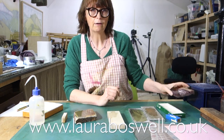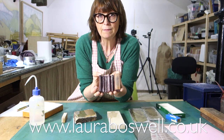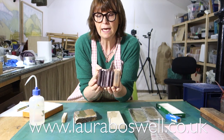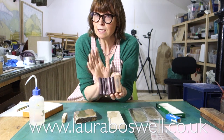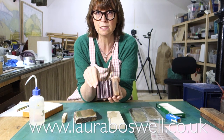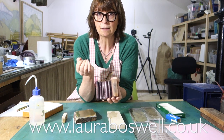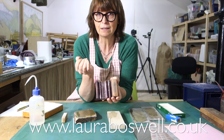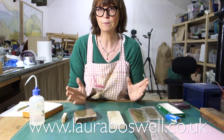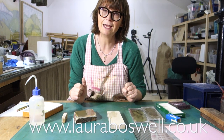One other thing before I go - this very battered object here. When I talked about honing tools, quite a lot of people asked me about these - I think they're called a slip strop or something like that. It's a stropping system and it works a treat. They're contoured so you can hold the tools over and against them, which makes the job easy. And if you are in lockdown and you have a belt and some scouring powder or cream, that will do the job too. So that's a brief round-up of the sharpening tools, and we will do a film about actually sharpening. Thank you for watching.